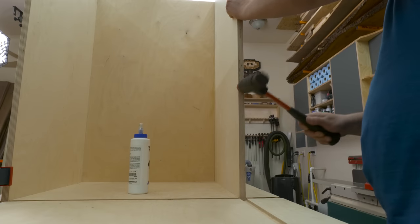With all the edge banding attached, I moved on to trimming out the pieces for my drawer boxes. I turn back to the track saw and cut out all of my strips needed for all my sides — I find this a lot faster than trimming out all my box pieces individually. From there I set up a dado stack to cut in the groove for my box bottoms. Since these drawer boxes are going to store some pretty heavy tools, I'm going to use half-inch material for my box bottoms as well as the sides. I can then cut that half-inch groove into each of my strips. Cutting the groove this way is a lot faster than doing all these boards individually since I can knock them all out in one pass. A feather board giving downward force above the blade helps out a lot to make sure everything is nice and even across the groove.